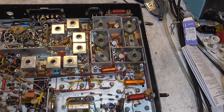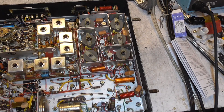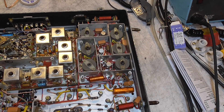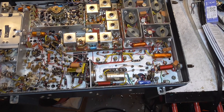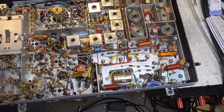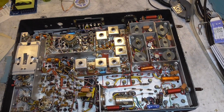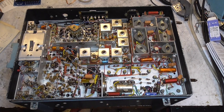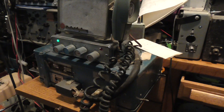You can see the old ancient transistors — the OC171s, all germanium transistors. This has not been restored, and incredibly it still works. Usually those guys start growing little whiskers inside their cans, but apparently that hasn't happened yet, so hopefully it lasts a little while. We haven't done anything to this except give it a little alignment and tune-up — original capacitors, original pretty much everything.